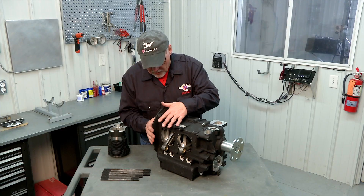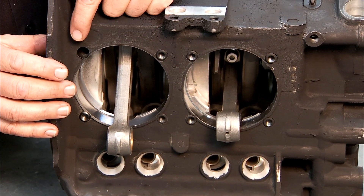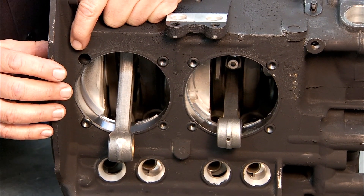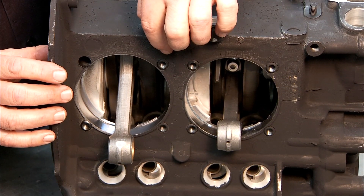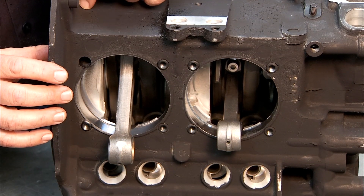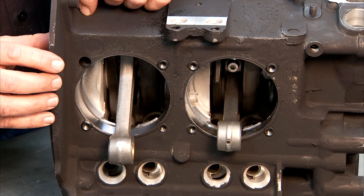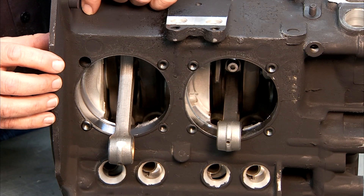On our case on this right side of the engine — we call this the right side as it's bolted onto the airplane — you'll notice this upper rear stud location looks a little bit different. The case saver is actually recessed back into the case. These case savers are basically steel inserts that our hold down rods thread into. This particular one is just recessed back. We occasionally get somebody that looks at that and thinks the case saver might have fallen out — that is not the case. This one is supposed to look like that because the case saver is back inside the engine case.